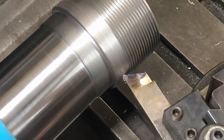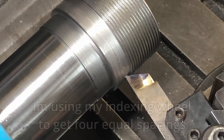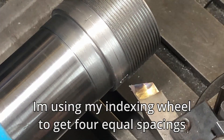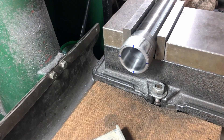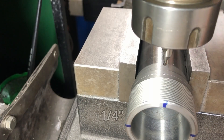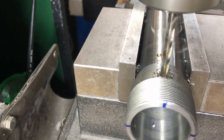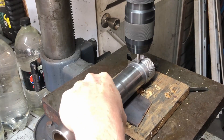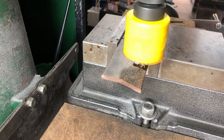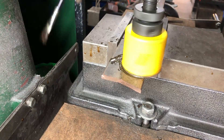Here I'm marking out an area for the holes I'm going to put in for the pin tool so we can tighten up and loosen off the collet nut. Then I go over to the mill, make sure it's vertical, and drill a 6mm hole for the pin spanner. I turn that 90 degrees and do the other side, then take the edges off. I was going to make the dust covers but I need to melt some aluminum for that, and it's raining, so I decided to make the pin spanner instead.